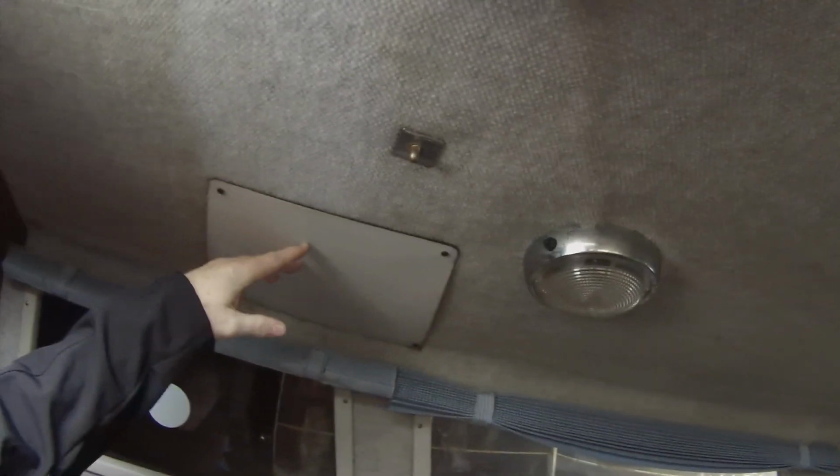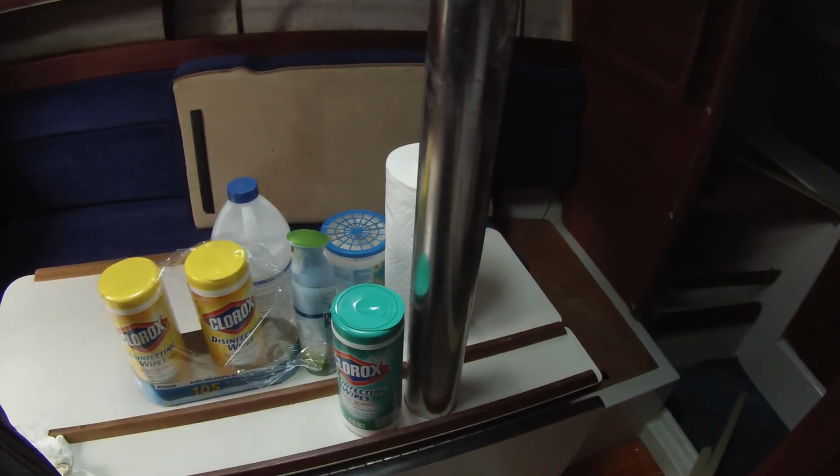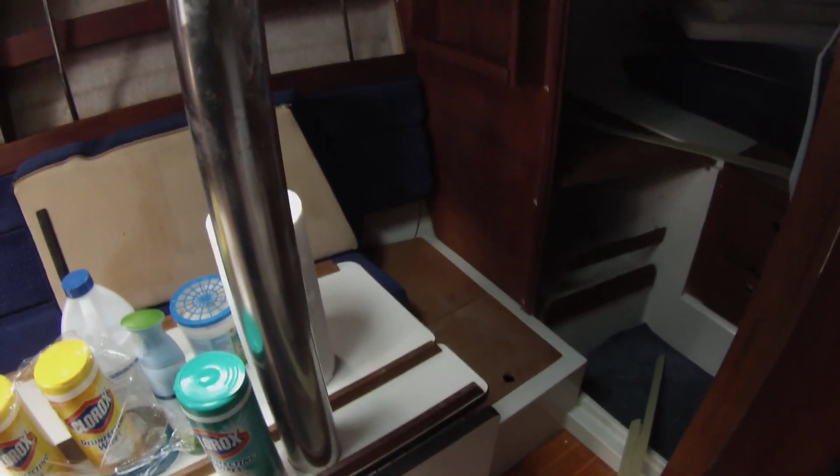But like I said, I have to open all this stuff up. Whatever these are, I guess, underneath the winches, and whatever's back underneath here. Up in here, I just need to open everything up. I've already been in the bilge down here. It's dry. There's no issues there, although this piece of wood here in the floor is a real pain in the ass to bring up, and it's delaminating on the bottom side. So there was moisture in there at one point. But we've kind of did a preliminary wipe down of all this wood. Nora helped me with that. I did most of this area. You know, hatches need, if not rebedded, rescreened for sure. These things I would like to get replaced. Everything just needs clean.